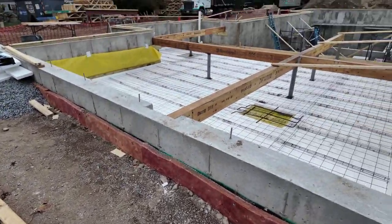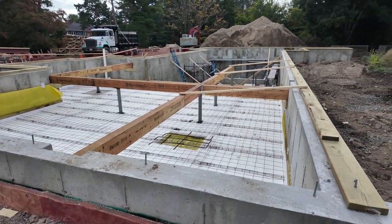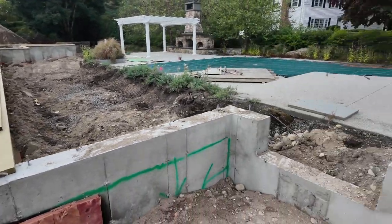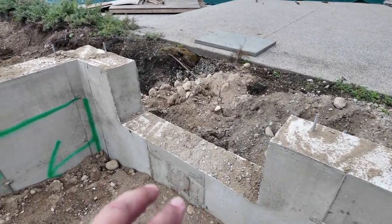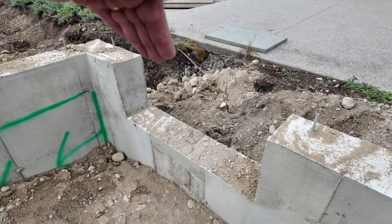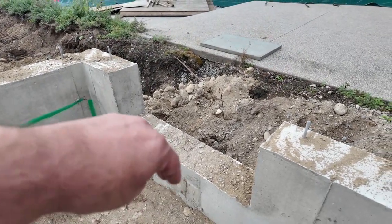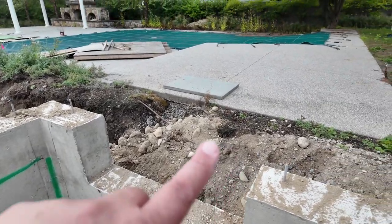And you can see the hole there. But let's take a walk around the backside, actually. So we have this dropped, and what they'll typically do, this is lower than the slab. They'll dam that off at the back, and they'll grade this up, but the slab will be basically a turned down slab that rests on there, because you can see where grade is.